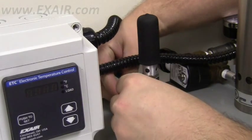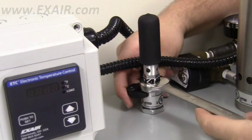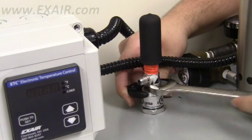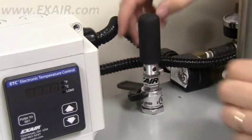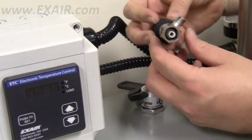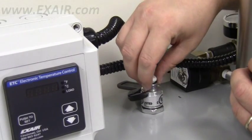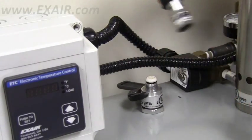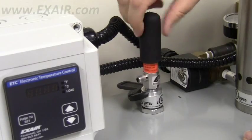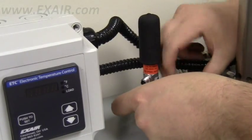The generator in a NEMA 12 unit is accessed from outside the enclosure. The main body is threaded into the cold end assembly. You can hold the cold end assembly's retaining ring with a pin wrench while loosening the main body, and the generator is removed. To reassemble, reverse the steps: place the O-ring and generator on the cold end assembly, thread the main body back in place, and tighten securely.